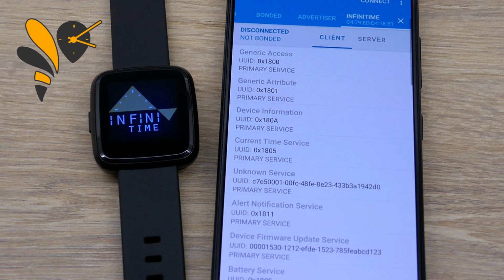That will show you how you are progressing from one to the other. That's our blue pine cone just come up. And it's actually fairly quick, the process, once it's actually started running. So what it's doing there is just stepping up through that blue pine cone. When it turns white, the wasp bootloader will be in place, and we're ready to do phase 2, which is to install wasp-os itself.